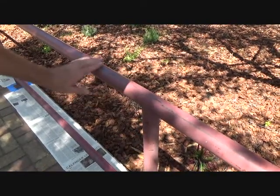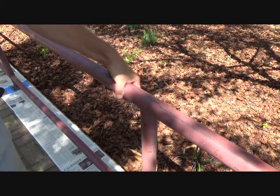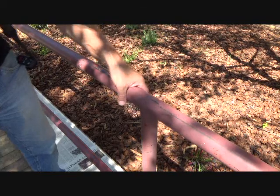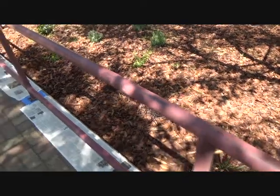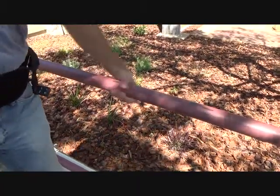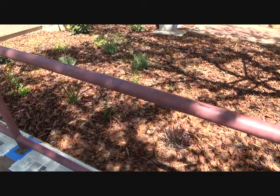Here's a tip: don't just go by what's visible — run your hand along the rail because you can still feel bumps you may have missed. Put your hand all the way around it, because there can be loose bits right underneath that need to be scraped too. The last thing you want is to finish the job and pat yourself on the back, and then somebody runs their hand along the handrail and feels rough spots. Check out your whole project, because your paint job is only as good as the prep.